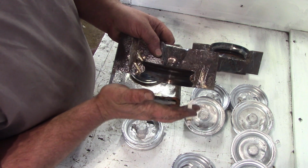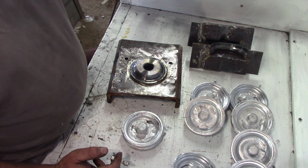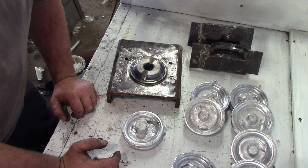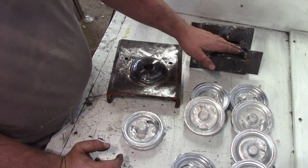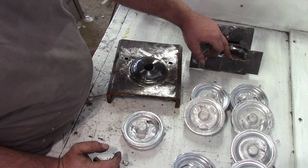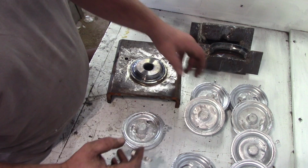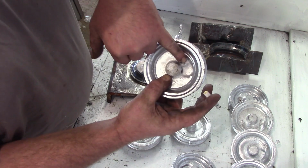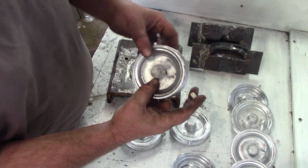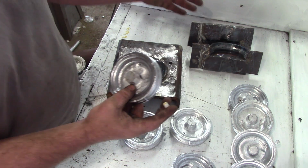And then when the aluminium's contracting as it cools, because aluminium has a tremendous coefficient of expansion, you know, probably bigger than anything else. Means it expands and contracts more than steel, for instance, when it gets hot and cold. So when the metal in the cavity of the mould cools down, and the throat of the riser is blocked by solidified aluminium, the cavity itself contracts in on itself, which means there's hollows in the hub, if you like, of the pulley.